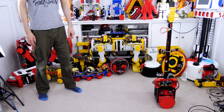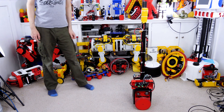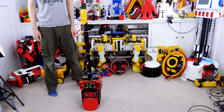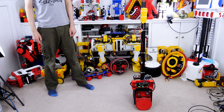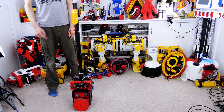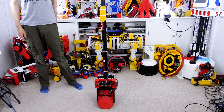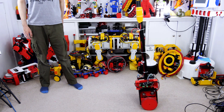One thing I thought I'd try was making the robot really tall with a much heavier battery at the top, because bigger things with more mass fall over more slowly and that makes them easier to control. This is without position hold and you can see it's pretty stable - it's almost as good as a Segway, which of course is quite a big machine and generally has a person on top. I'm pretty happy with the tuning and the general balancing - there's a tiny oscillation but you pretty much wouldn't know it was actually a balancing robot if you left it still. With position hold on we do get a bit of oscillation and some overshoot, but once it's standing still it won't wander away by itself.